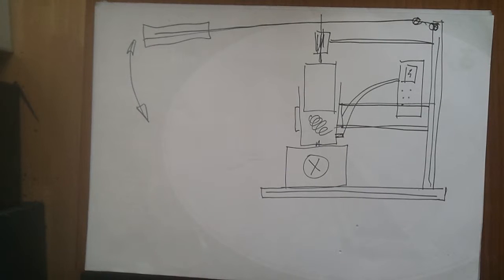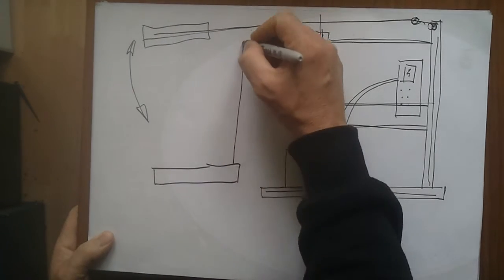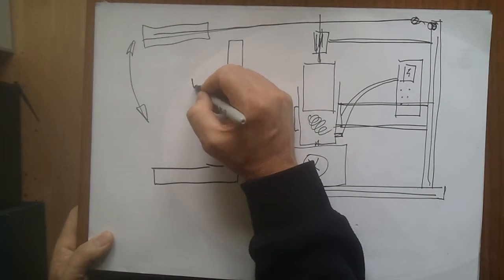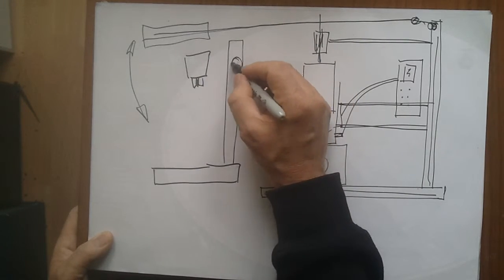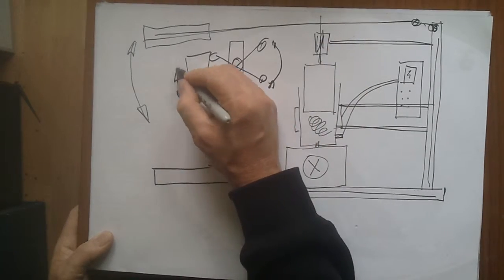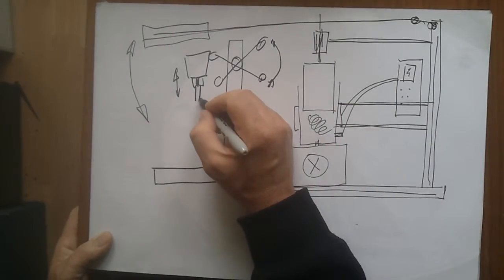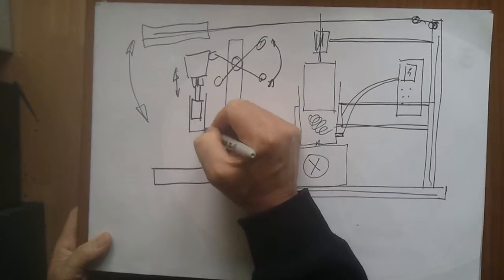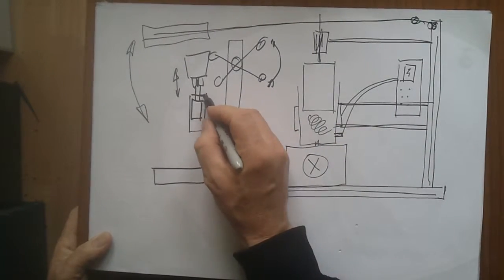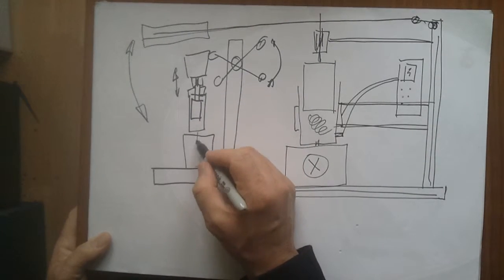There has been an attempt by LNS Technologies in America to get around the overhead by observing the fact that most shed-dwelling fellows have a drill press. There's the chuck and a rotary spider-type handle that you rotate to raise and lower the chuck — and that is pretty much the same as a plunger. So you can repurpose this by sticking a piston up in there, having an injector here, arranging some way to support it, and then putting your mould under there and making your part.